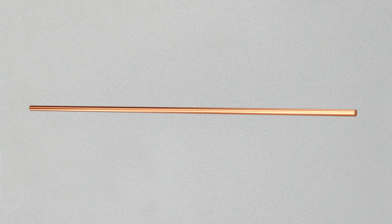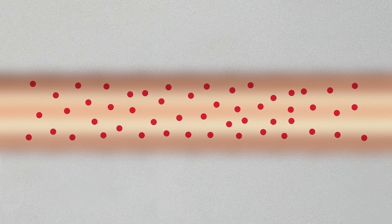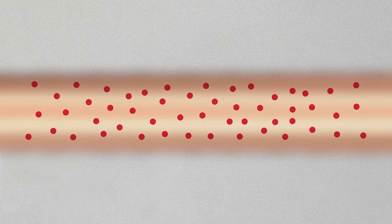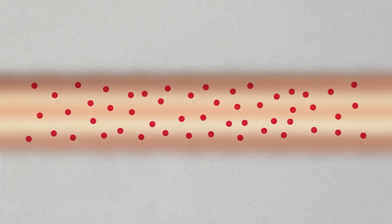What causes the Seebeck effect? Let's look inside this short bit of wire. You might know that metals have these free-moving electrons. Normally, electrons are bound quite tightly to their atoms, but in the case of metals, some of the electrons are free to move around within the bulk of the metal — that's what makes metal conductive. When electricity is moving through metal, it's because those free electrons are flowing through it. These freely moving electrons also have some thermal energy, unless the metal's at absolute zero, which is rare. I'm showing that thermal energy as a jiggle of the electrons, because that's all thermal energy is — it's atomic-scale jiggle.